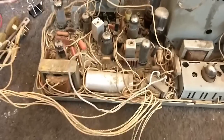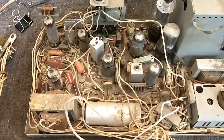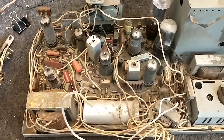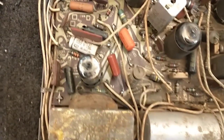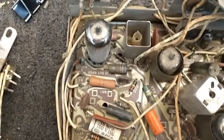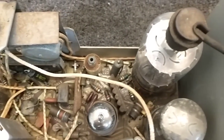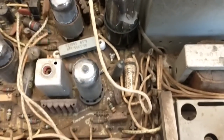On today's episode our goal is to get this board up and out of the machine so that we can begin more meticulous cleaning of it. Many of these wires are labeled so you can put them back into the proper positions. What I typically do is label each wire before I take it loose, so there's no difficulty as to where it went.